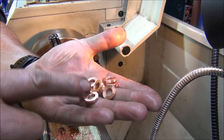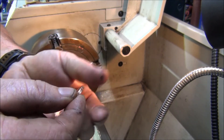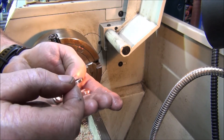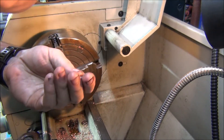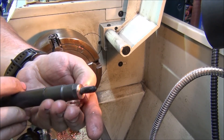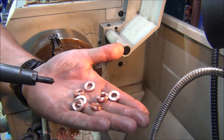Okay, I'll finish machining them up - they all come out good. I've got 8 of them, a little 2.5mm thick, I think it was 15.5mm OD, and the ID was 8mm I think it was, so I'll be able to go and fit these now. Let's see if they fit over the top of that - that would be good wouldn't it? There we go, fit on that. Okay, this job's finished, and thanks for watching.